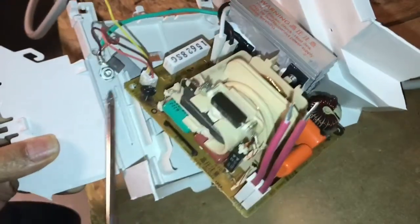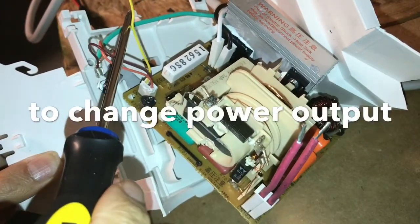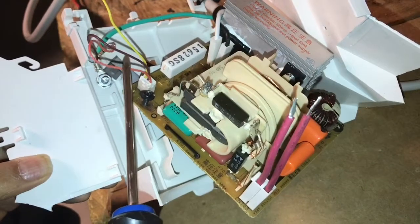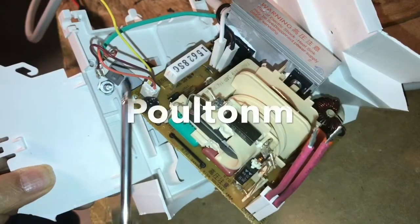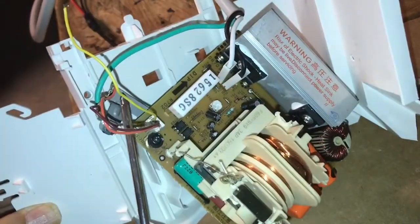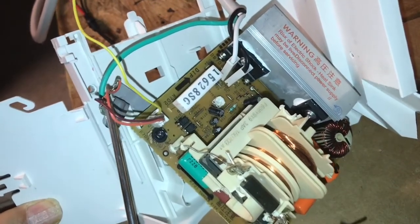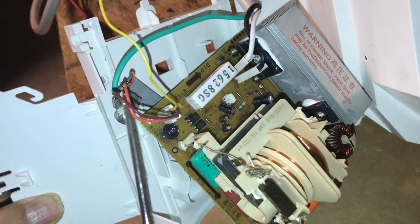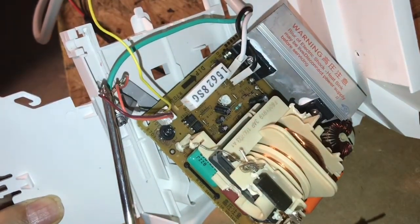There are three control wires. You have a yellow wire which is your square wave pulse modulated signal that runs this thing. You have an orange lead which has to have some kind of signal on it — it can't be left to float. Polson said it's okay to connect this to ground via a 1k resistor, which I've done here. The brown wire is connected directly to ground.